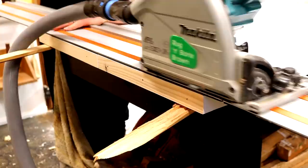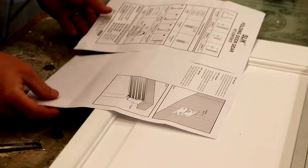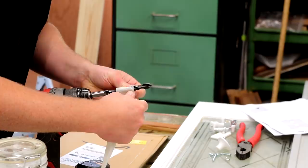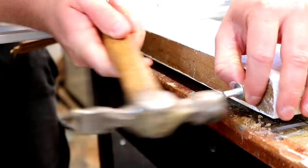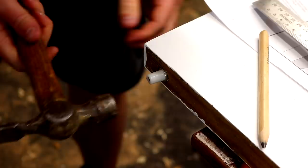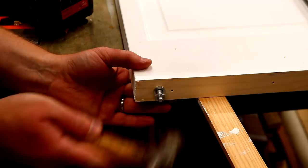By this point the doors should be the right size for the opening, minus space for the hardware at the top and bottom and a couple of millimetres either side. To fit the hardware I needed an 11 millimetre drill bit, which I had to buy. I need to drill some 30 millimetre deep holes so I used the masking tape trick, and they need to be 32 millimetres in from the edges. These pins just get hammered in place — a locator pin at the top, a plastic runner at the top too which I managed to drill in really wonky but that shouldn't matter, and one on the bottom which has a height adjustment nut in it.